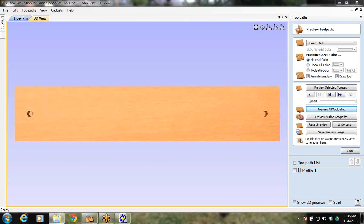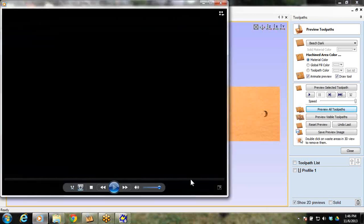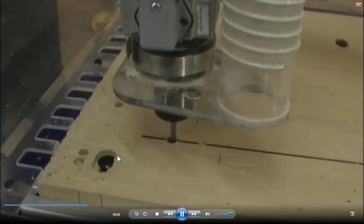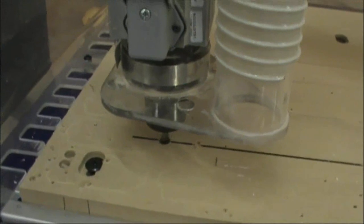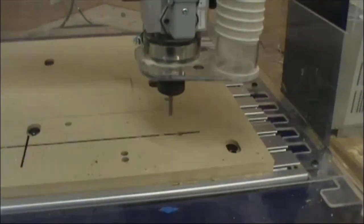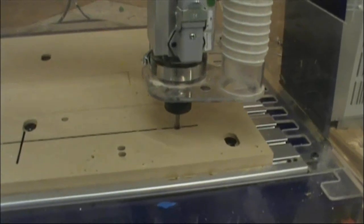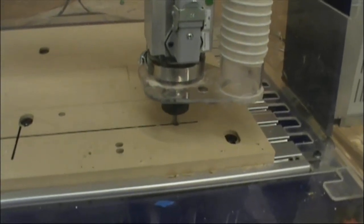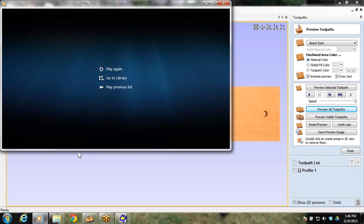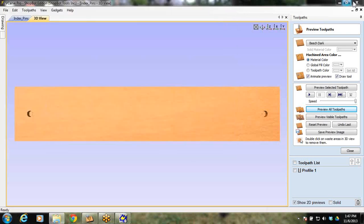So take your Z0 plate and 0 it to the machine bed, and then go over here and drill those holes. See how they're set right off the center of the X0? So drill those holes into the spoil board. We're going to need those indexing holes when we flip it. So as long as those holes match the holes in the top of the board, we're fine. So with that being said, run those holes in, and now we want to put our part on the machine.